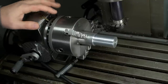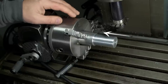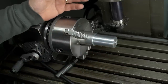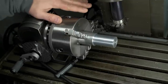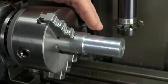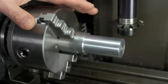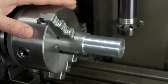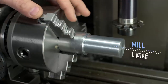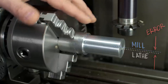We're on the milling machine — the dividing head is installed, hasn't moved since those last two videos, and I've got the right cutter installed. I want to cut into the chuck, in towards the dividing head. It would have been nice to flip that cutter and cut on our side for better visibility, but I don't have enough Y-axis on this machine. If these were gears you really needed, you'd want to take care about how you move the blank from machine to machine. I just turned this down on the lathe in a three-jaw chuck and moved it to the three-jaw chuck on the mill. The odds are pretty high you'll pick up concentricity error doing that.